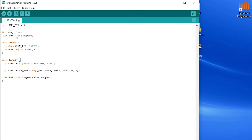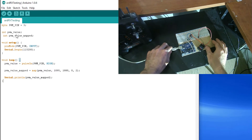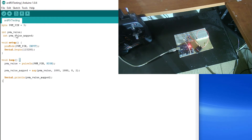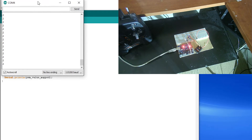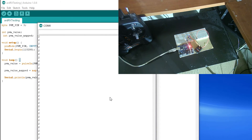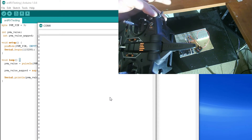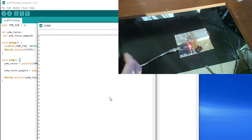I'm going to turn the other camera on and plug in the Arduino. I'll hit reset and upload the code. The code is now uploaded. I'm going to turn on my transmitter and open the serial monitor. As you can see, we're receiving a 2 at the moment. If I flip the switch — now we've got a 1. Now we've got a 0.